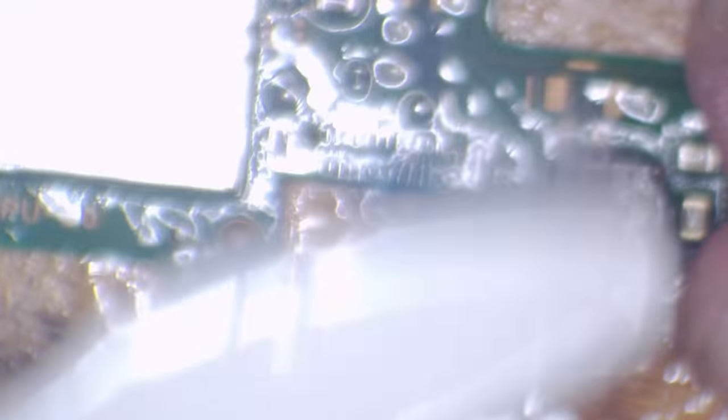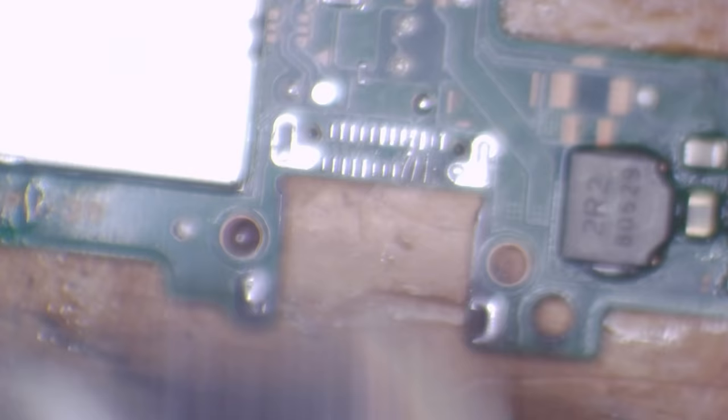Give it as many wipes over as you can with isopropyl alcohol, or even ultrasonic cleaning, before you put the conformal coating on. Conformal coating is absolutely necessary for this job — I don't think the jumper wire would ever hold without it, not in my experience anyway.